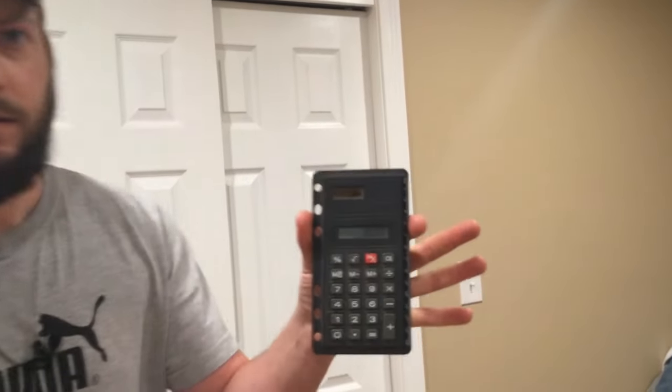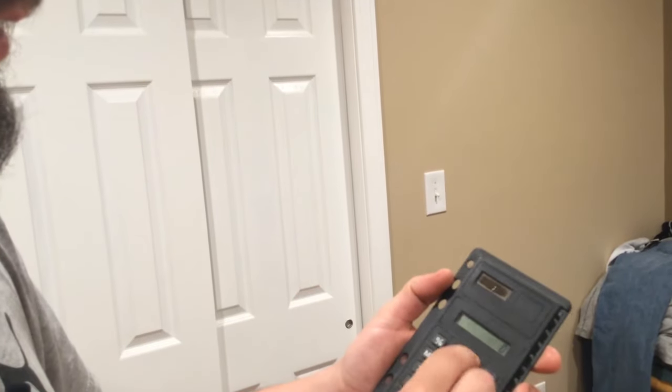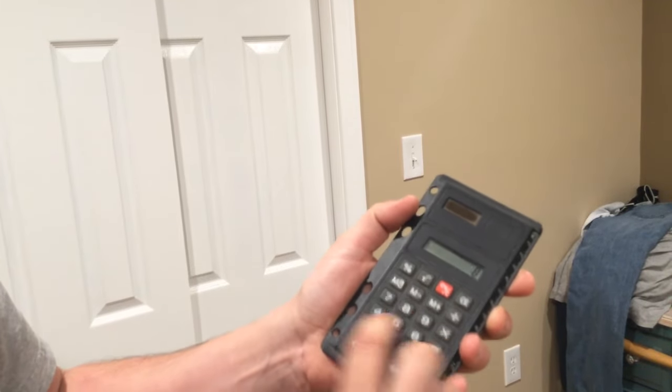Here's something where people make mistakes — you want to take that total and add 10%, because you're going to have cuts, you're going to have waste. You might drop a tile, make a mistake, or have a piece of flooring that's no good. So you do 148 times 0.10, which equals 14.8. A quick trick for adding 10% is to take your number — in this case 148 — and move the decimal point one place to the left, giving you 14.8. For example, if you had 8,000 square feet, you'd move the decimal to get 800, then add 8,000 plus 800 to get 8,800.